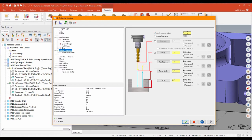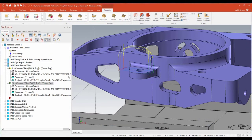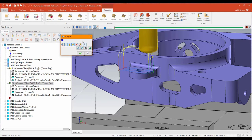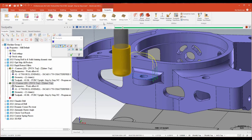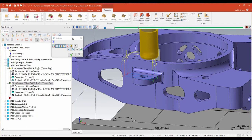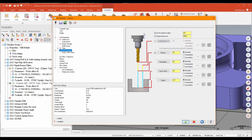I'm going to put in a base value of half an inch and see what that gets me. With that checked and regenerated, you can see I'm now getting really nice arc moves. They're a little exaggerated — I could bring those heights down a little bit to look nicer or tighter — but you can play with it as you want. It's certainly just a nicer way to get that tool to reposition. Just arcing around — it feels a little more efficient, a little smoother, a little safer. And I can still, if I don't want rapids, output all of that movement as a feed rather than a rapid.